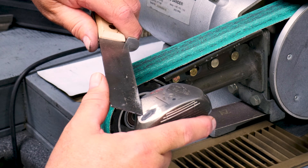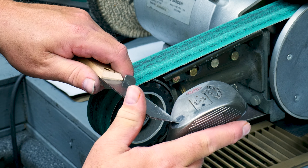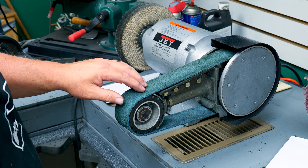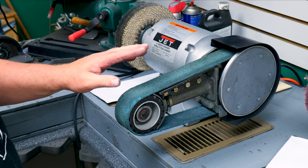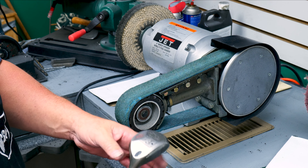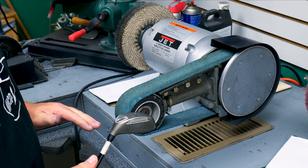We started marking it up a little bit — it's almost flat, but not quite there, and there's extra glue. I'm going to remove that with a knife so it's nice and clean before using the blue belt. When we're doing this, we're really not worried about scratching the metal because we're going to clean it up. We want a decently sharp knife to take off all that excess. The blue belt is a more dense version of my wavy wheel — it doesn't eat as much as the red and leaves a nice satiny finish. We're going to work this over and dress up these sides to blend it all in. Since it's painted all around here, you go straight in to ensure you don't get into the paint.